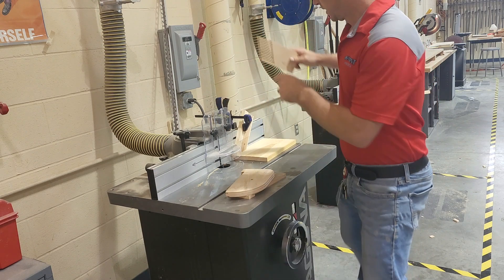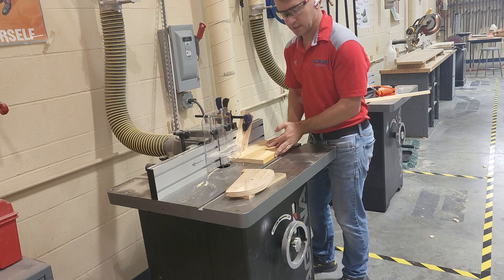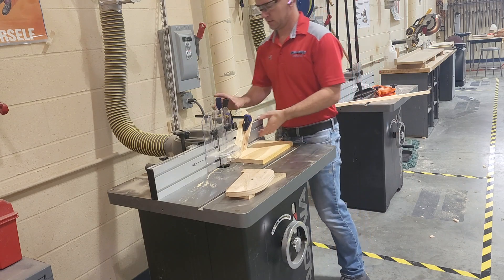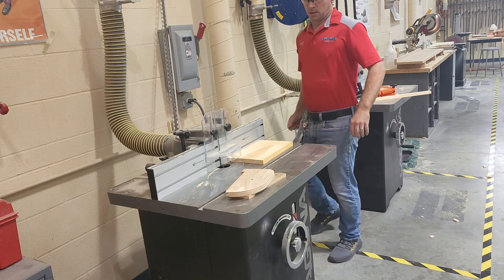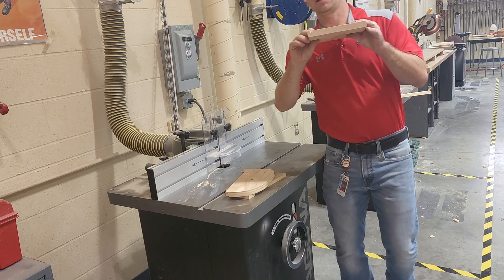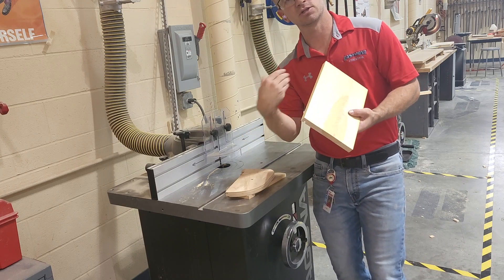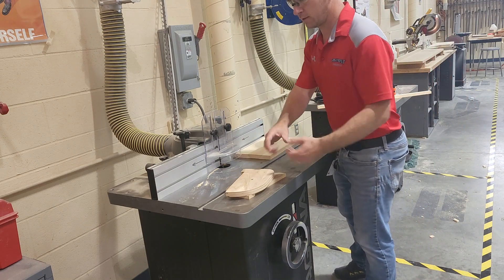A feather board is designed so that those fingers bend back a little bit as the board goes through, putting pressure to keep it down. You could clamp down both sides if you needed that support, so you can focus on getting the board through. It will be a little bit harder to go forward and harder to go back because the spring is pushing down and biting into the board. The pace I want is pretty slow — we have to go the pace that the router bit allows. Do not push too hard; it's a patience game. If it can't remove material fast enough, you'll bend and snap that bit right off.